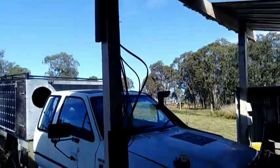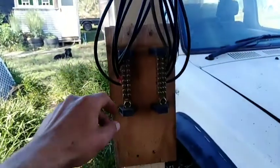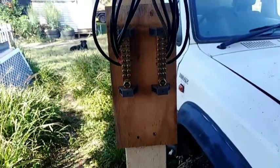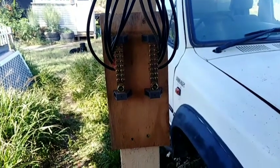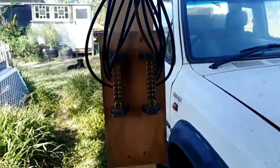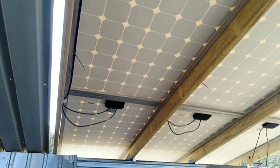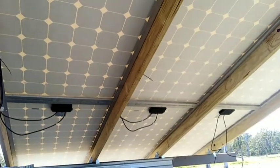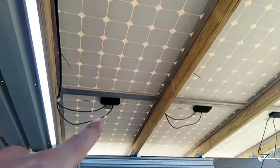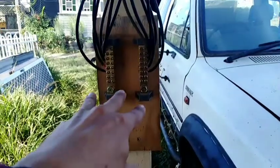Once I've got them all wired up I'll get these wires here tidied up into a nice loom, and I'll probably encase this in an actual plastic junction box because it's not really supposed to be open like that. I always run them in parallel with each other — each individual one goes down to the busbars, so there's no joining the panels together in series. They all just individually go to the busbars.